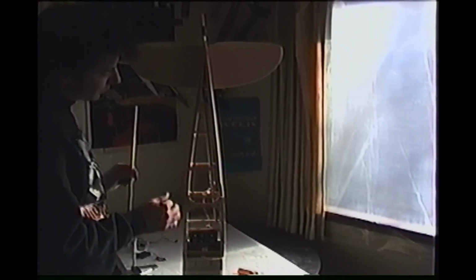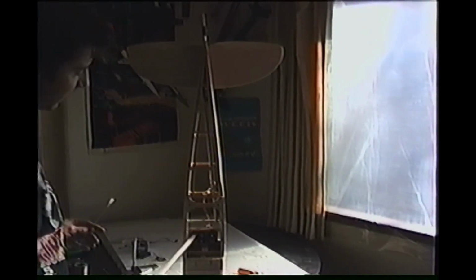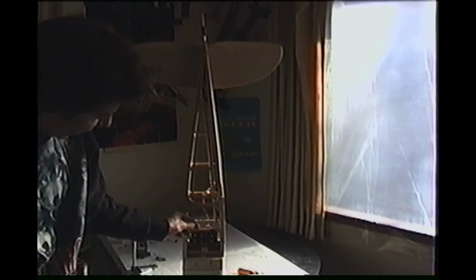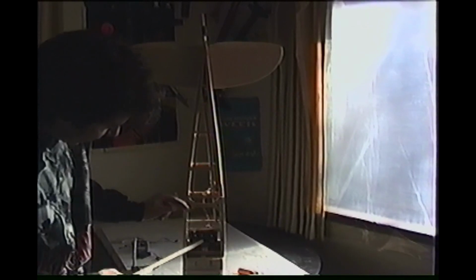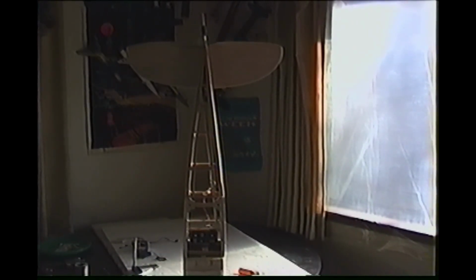And then you're just going to try and get this rod or the dowel in the center line of the two. Just kind of compromise. Make sure there's no hits or anything. And now we have to rig the other end, so we're going to have to hook another clevis up, but I'm going to do a Z-bend down here. And you can see I have a preload condition, how my rod is preloaded over to one side. So I'm going to have to find neutral on that rudder up there.